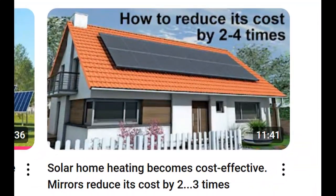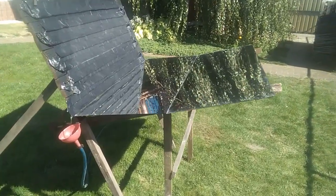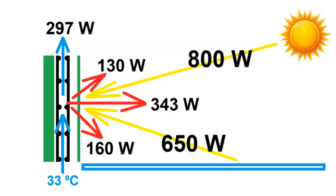The solar heater can suffer if air is not circulating through its pipes on a sunny afternoon — that can increase the temperature of the black pipes to over 100 degrees Celsius, which can melt polyethylene and polystyrene parts, although other polymers should be able to withstand those temperatures. Unfortunately, our mirrors will increase the temperature by another few tens of degrees. My old video from two months ago described various mirror systems which can radically increase the mirror gain factor up to several times larger compared to this horizontal mirror.